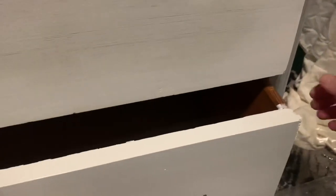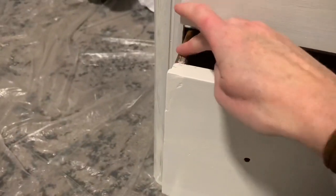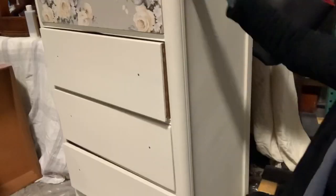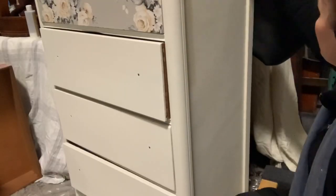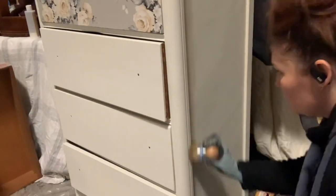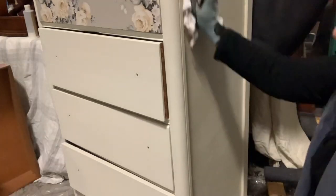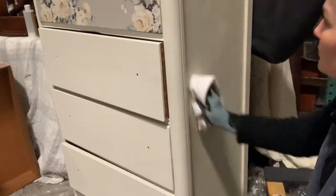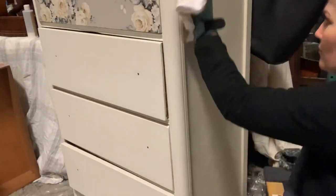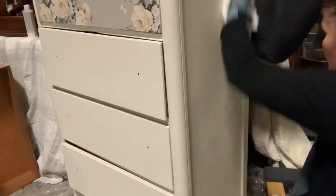Fun tip: if you get a little mess up on your drawer sides where you don't want the paint, it just wipes right off. If you can't get it off with your finger right after, you can just take a little cloth with some water on it and it will buff out. For sealing, I went with wax because I enjoy the texture of it. The top I did seal with poly, but the body of the dresser gets less wear and tear, and I just think the matte look is a nice finish. Once it's all buffed in with the brush, I go over it with a cloth to wipe everything back, and it gives it a little sheen too.